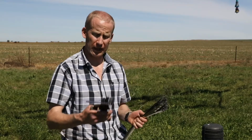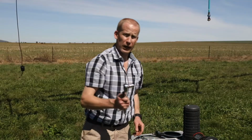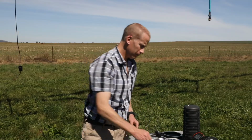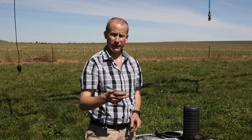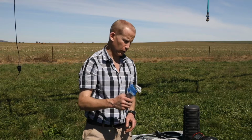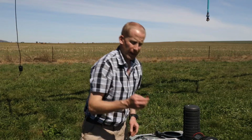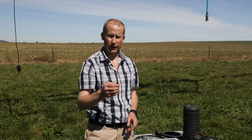To mount the solar panel, we use stainless steel cable ties as well as a stainless steel cable tie tensioning tool. To mount the bracket, you need a socket spanner. You need a small socket for mounting the enclosure onto the bracket. And we need Allen keys for mounting the antenna into the extended antenna pole, and a small flat screwdriver for mounting the pressure sensor into the radio.